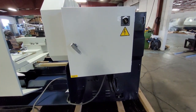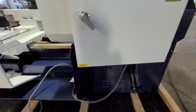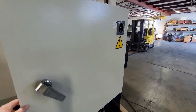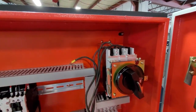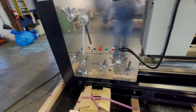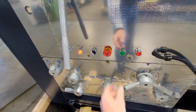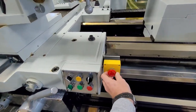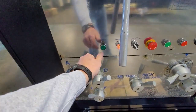After receiving the machine, one of the first things you want to do is confirm that the voltage you're putting into the machine is the same as the stickers on the outside of the machine. You bring your three hot leads into the top of this main switch right here. After connecting the power and turning on the main switch in the back, you should see this power lamp button is on. Make sure all your electric emergency stop buttons are out, and then power up the machine with this power-on button right here.